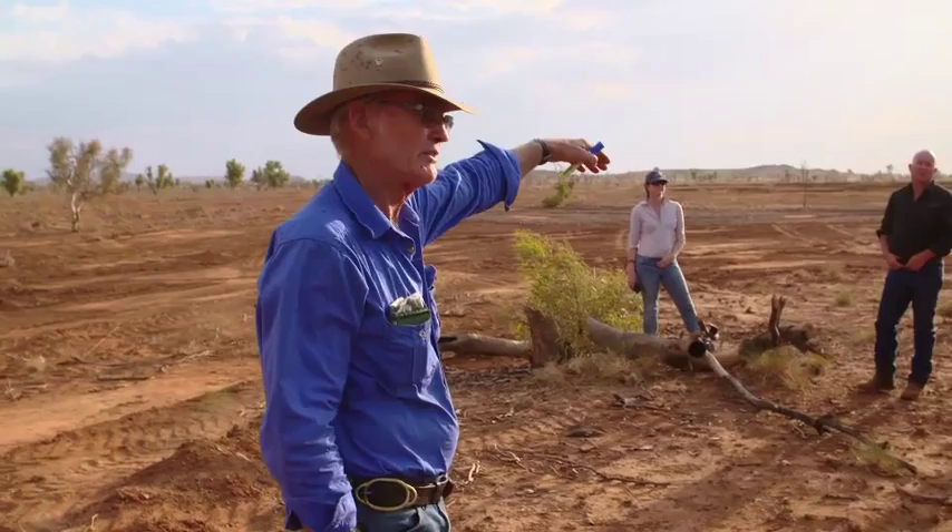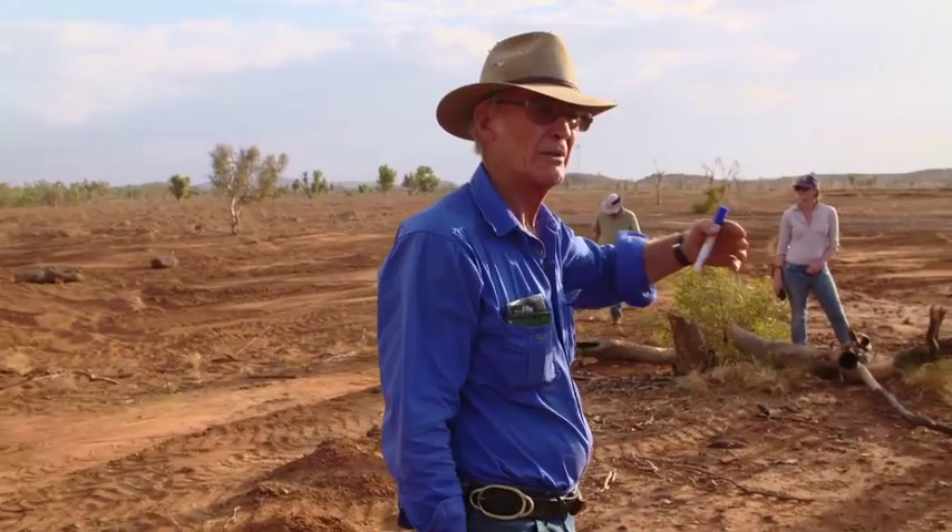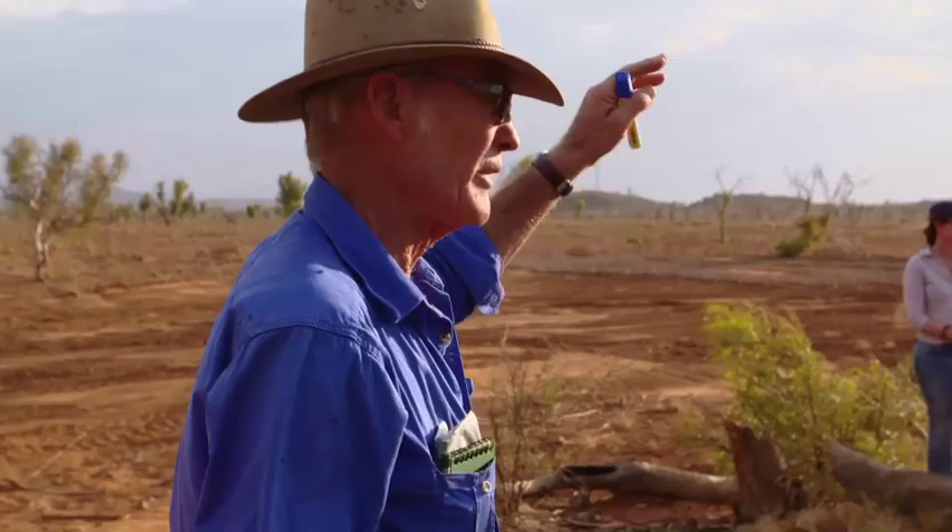The water will spill out of that pit. Unfortunately, because of the lay of the ground, it's only going to spill out in two or three places rather than anywhere over the full 20 metres. That's where you put the shingle — when the water hits it, it has to filter through a 100mm layer of rock to take the force out. In a big rainfall event it might carry sand through, but that doesn't matter because the sand fills in any hollows.